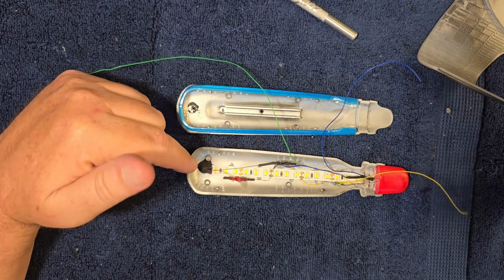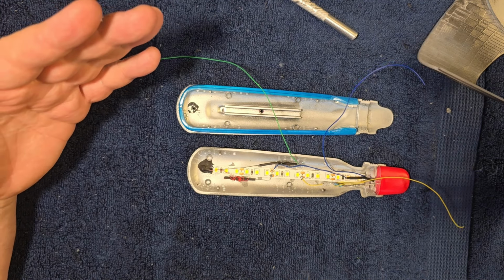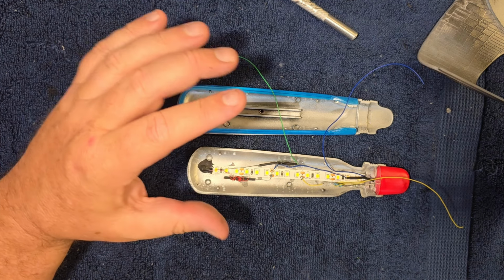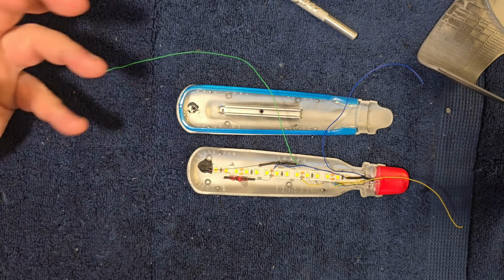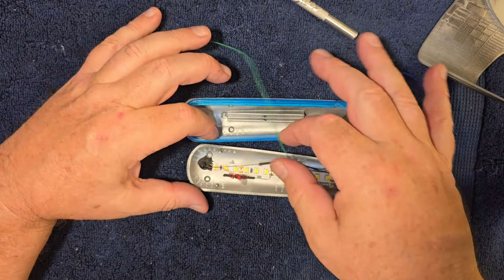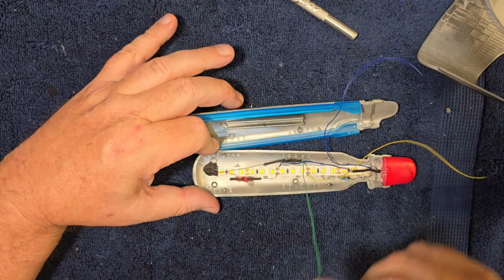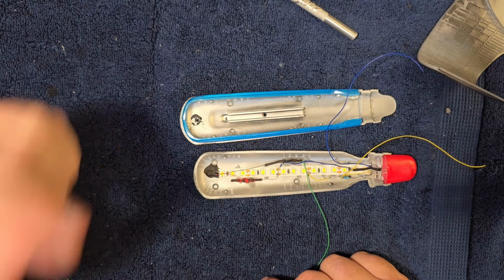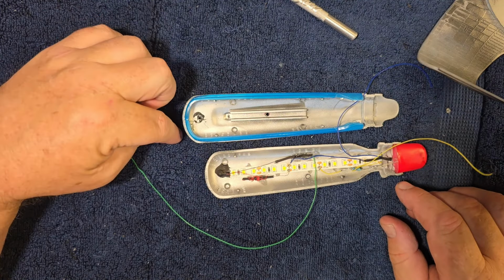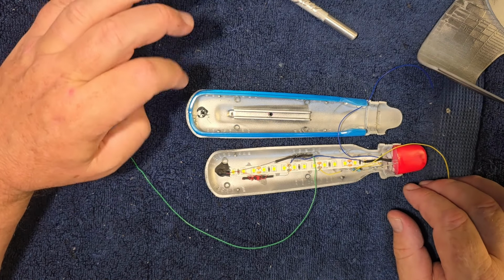if you're not aware, the positive wire from these lights goes to any other positive wire. The negative wire from these, the black one, is what gets connected to the nav board to control the blinking frequency. So that's why we have these three here. This green one that's going to connect to the strobe effect on the nav board is for this light there. This is the top of the nacelle. Now, originally I was going to do top and bottom, and if you go back to the show, both the top and bottom of the nacelles blink in unison.